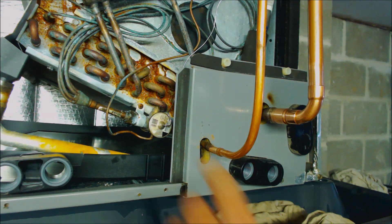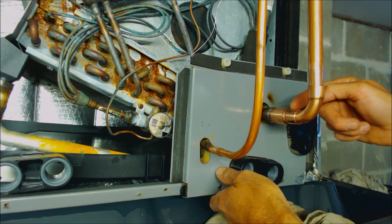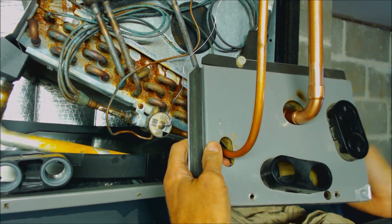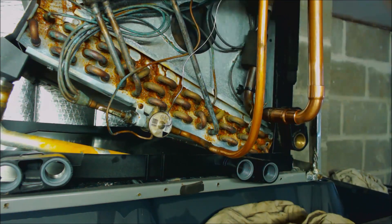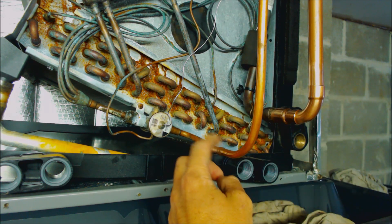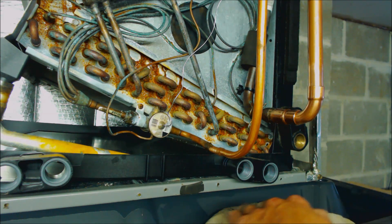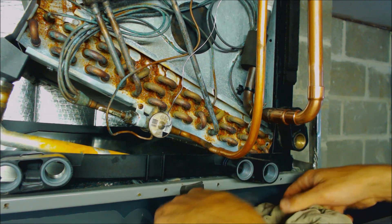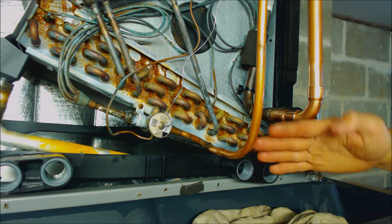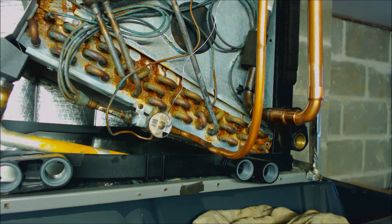You want to be aware of making sure that your TXV and your TXV bulb are going to stay cool while you're brazing. Whenever possible, make sure you have the line set out — not too far out in front of you, but enough to be able to get this plate off — so that you can put a wet rag here, or take the bulb off. When you're brazing the liquid line, you can put a wet rag right here to protect the thermostatic expansion valve. We're going to do the vapor line first. I've made a little pan here out of a wet rag so that if braze falls, it doesn't fall in the plastic pan. Make sure you have multiple wraps of a rag to make a little pan. If a ball of braze falls off the joint, that means you're using too much braze.